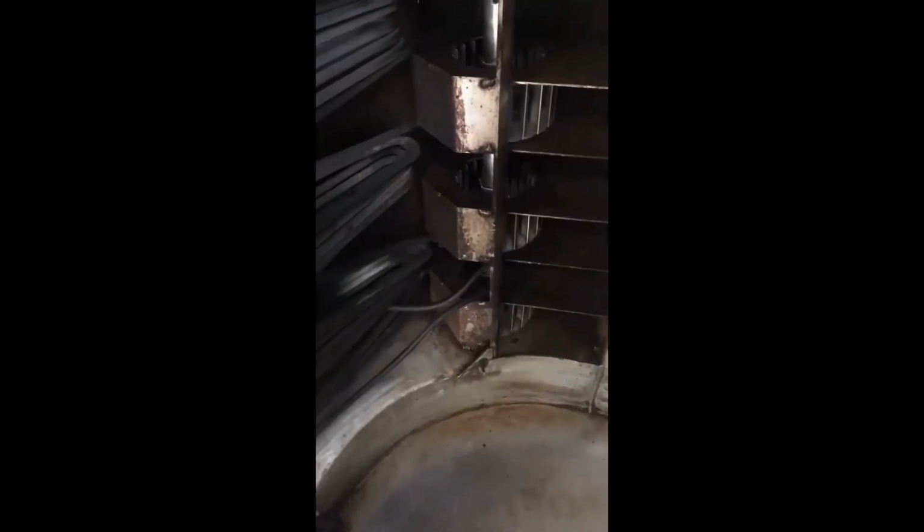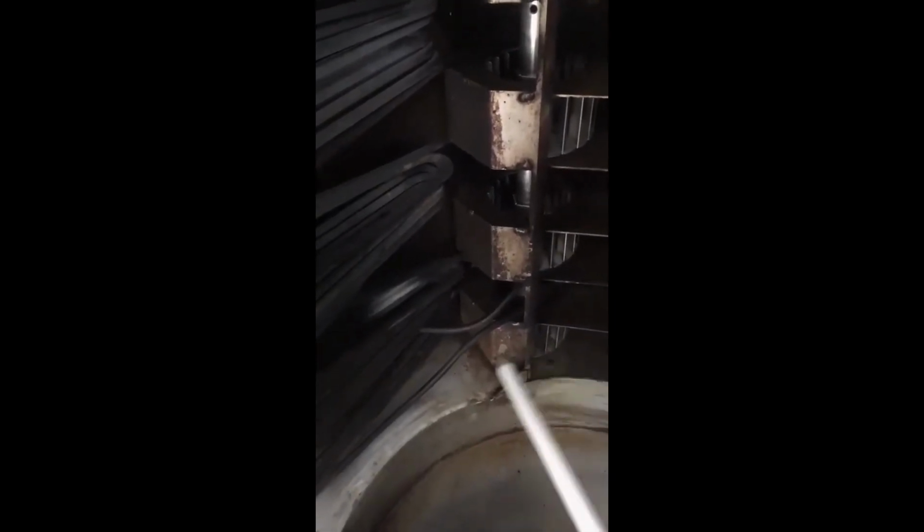At this point we have cleaned all the debris and carbon from the bottoms of the fan runners and the element box. We have blocked the floor drain with a rag and we have closed the actual floor drain at the 3-way valve. Use a dustpan and brush to remove all of the carbon and filth off the oven floor. Do this before removing the rag from the drain.